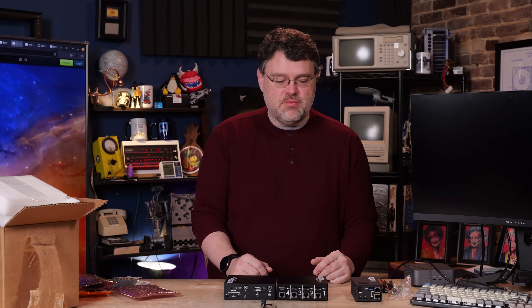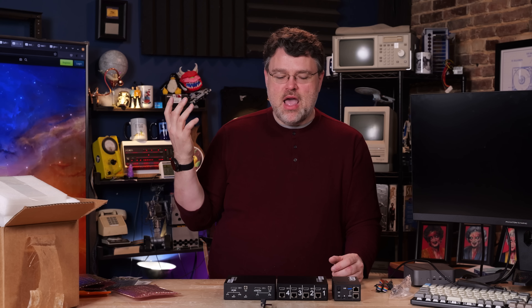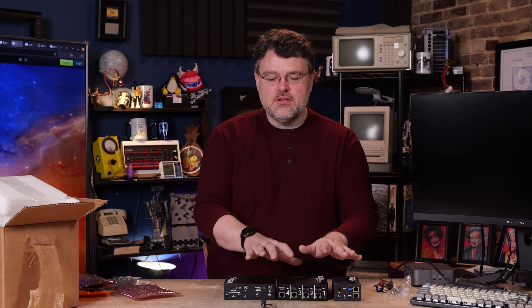We're still working with 1080p — 1920x1200 or 1920x1080 — and you can do 60 FPS, though you really don't need that for remote network control. Hardware scalers do work, so if you have a 4K display you want to use locally, you can take it into a hardware scaler and split it to send a 1080p signal into this. It won't be as sharp as native 4K, but it works. If you have 20 inputs you'll need 20 scalers, but if you're fine with 1080p or 1920x1200 it all works natively.